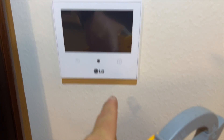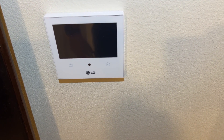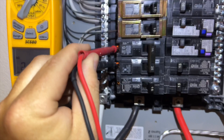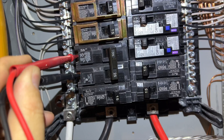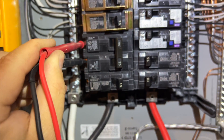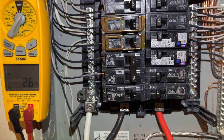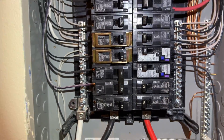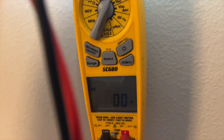The thermostat is off. I'm checking the breaker — we have 213, 212, so the breaker is good. I'll check the indoor head now that I've reset it, and if it's still not where it needs to be, we'll check the disconnect up on the roof. We still don't have voltage after resetting the breaker.